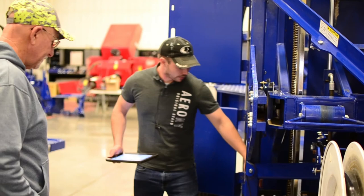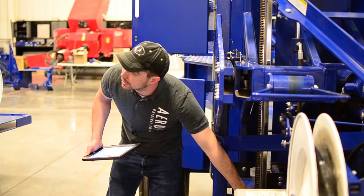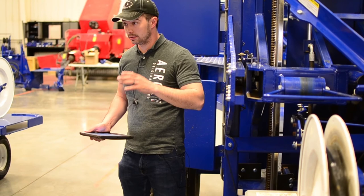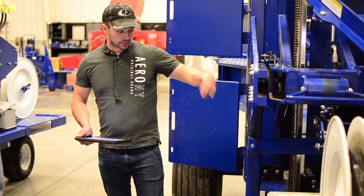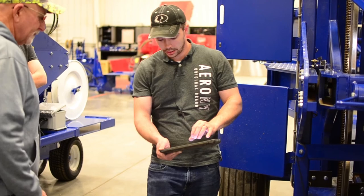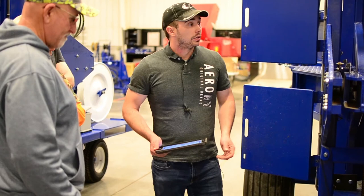Those extended hay sweeps sweep back and forth. When the strap guard arms come down and those sweeps are broken off, it just keeps packing chaff and the arms can't go all the way down. It's not going to read on the sensor bar — it'll stop saying 'waiting on strap guard arms at bottom position.' They're there, they just can't get down far enough. In manual mode you can come in, move them up, stop, shut your hydraulics off, clean it off, and you're good.